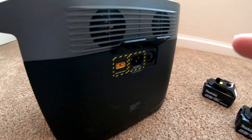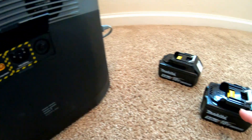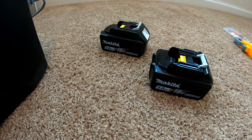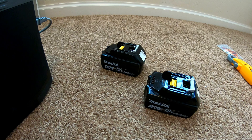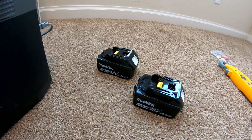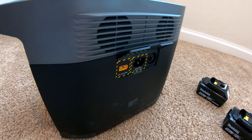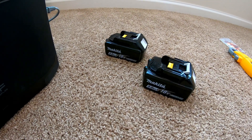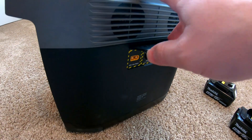Today I want to show you how you can actually put a fast charge in through this XT60 solar charge port using batteries you've probably got kicking around the house already that power your power tools. I did another video about doing this with smaller power stations and just a single battery. But today we're going to connect these up in series and plug it in and dump a fast charge into it. This is a really great way to utilize batteries you probably have kicking around the house already, and you can take them camping or whatever and get just a little more capacity out of your power station.